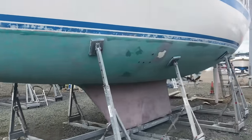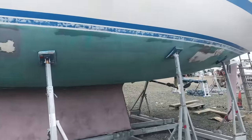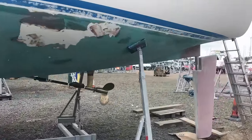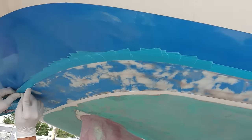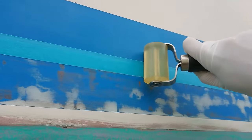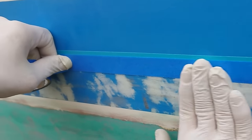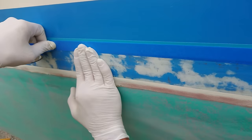Where you can see the green and grey paint, this is an existing epoxy barrier coat. There were 4 coats in total previously but as we've prepped the hull we've sanded some of this back, so we're going to put another 2 coats of epoxy barrier coat over this and 2 coats on the keel. All of the other bare or unpainted areas under the waterline we're going to be painting with 4 coats in total. The paint that's already on is International Gel Shield and that's the product we'll be using too. I'm overlapping 2 layers of masking tape here so I can stagger the edge a little.